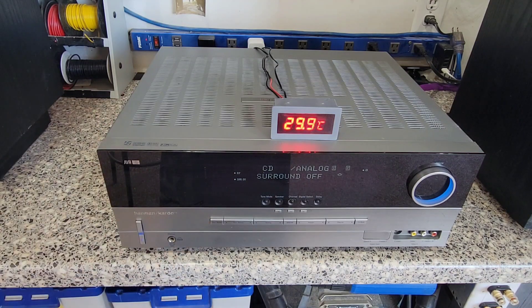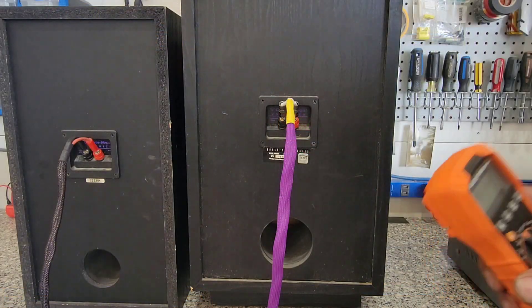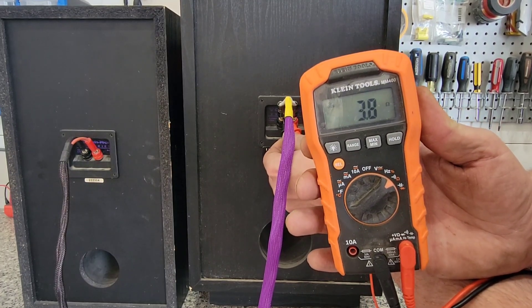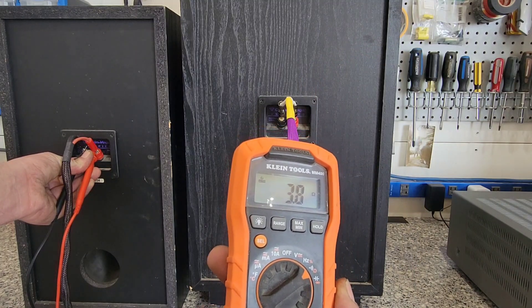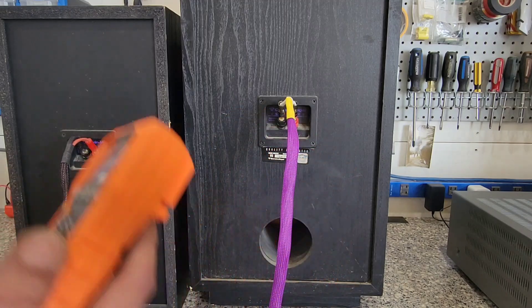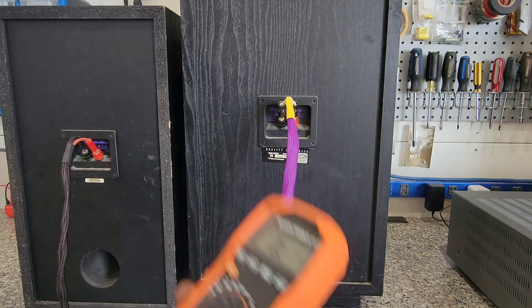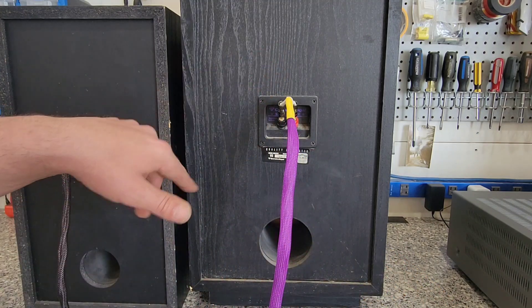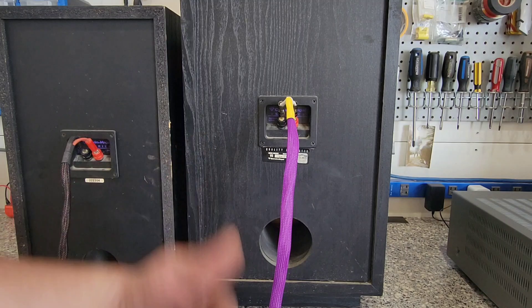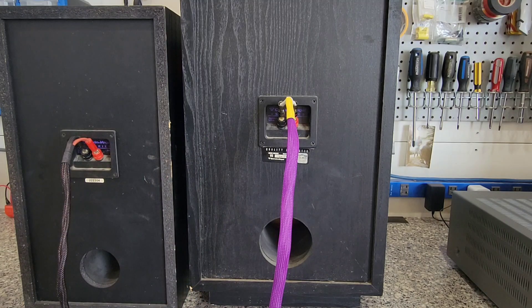While that's running, I'm going to show you what happens when you hook up a multimeter and test the resistance of your speaker as it sits. So we've got both the 100 and the 80 here. It's reading 3.8 — they both measure at 3.8 ohms of resistance. Again, it's not your nominal impedance, but I just thought I'd show you that. Now let's measure what happens when we hook them together at the speaker terminal going into the amplifier, and see what the resistance is right at the terminals.